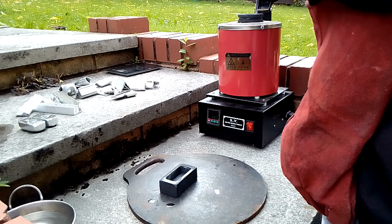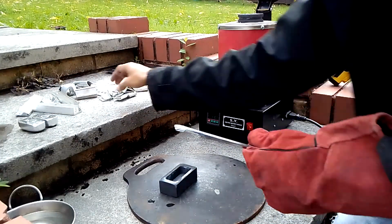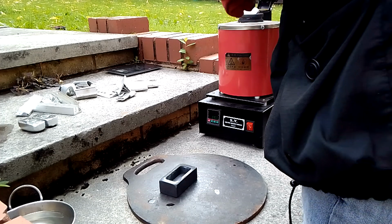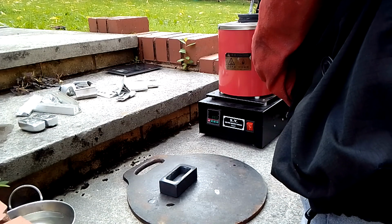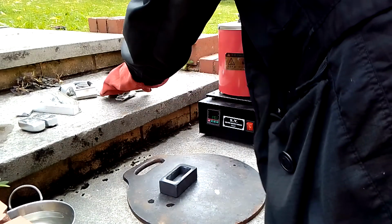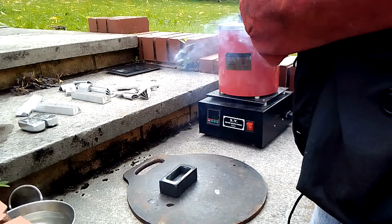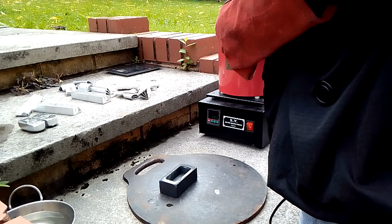That means I will have to add more material. Smaller piece. That'll do. And that piece. Careful not to touch any of this as it's going on. Okay, that's nearly full to the brim. A little bit more. That one. Yeah, looks kind of thin. Bit of weight to it though. And gone. A little bubble. That's the borax, eating the impurities out of the aluminium heatsink.